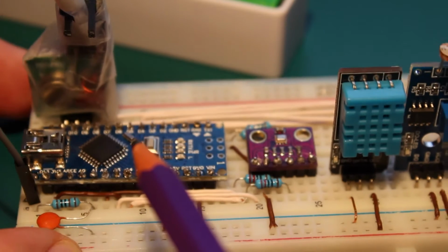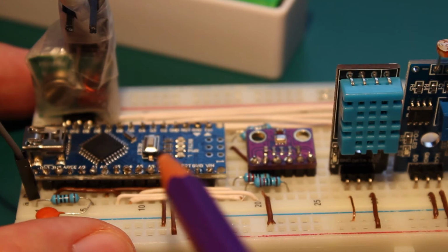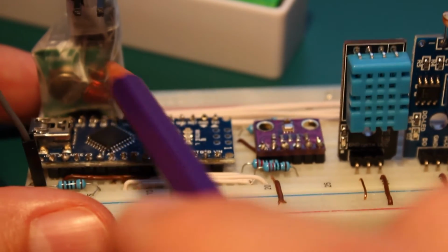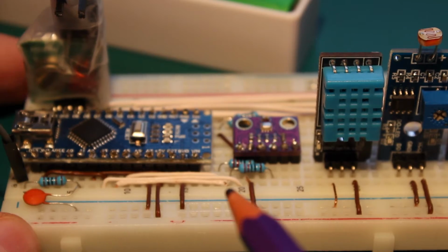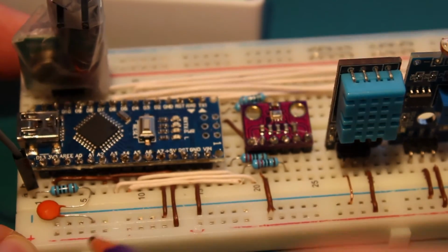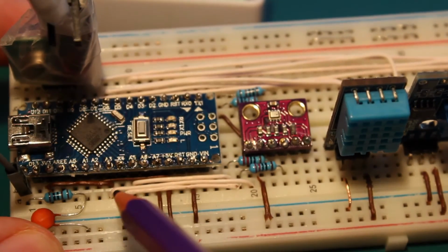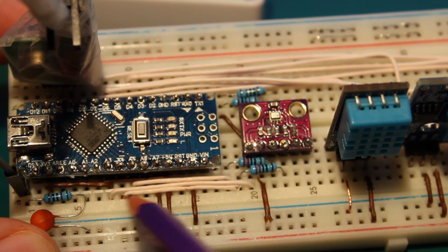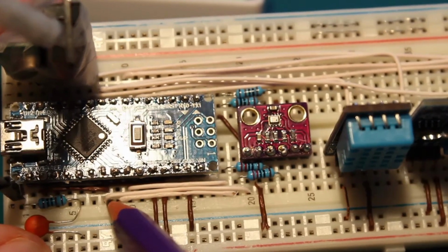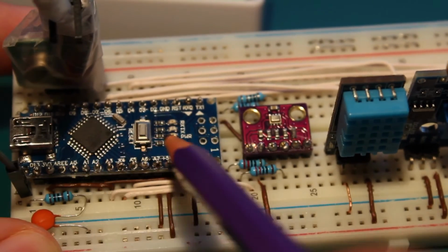Then this is processed in the Arduino. I will not make a screen capture in this video, but I will provide the links to the code. Then this is sent using this 433 MHz module, with this monopole antenna, and it's received by the receiver. We also have some analog readings. I like to send more information, like the voltages in the board. I'm reading the 5 volts, the 3.3 volts, and the 0 volts from the board with the analog input.